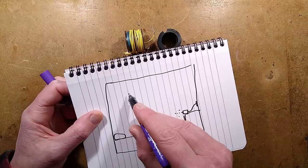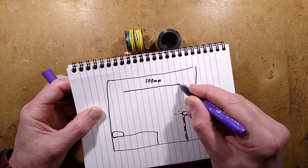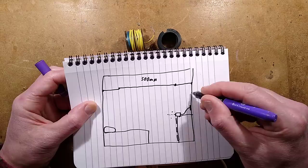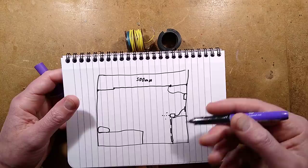The way this does it is different. The Ryazan unit has a thin 0.016 millimeter wire suspended in the air roughly 500 millimeters from the ceiling — that's almost two feet. Tied onto that is a bit of fishing line that goes over to the wall and around a hook, and then another bit of fishing line at the other end. That insulates it because this thing has a very high output impedance. The unit mounts on the wall and has a dangly wire — that yellow wire — that just twists onto the main wire. They say don't let that wire go near stuff because it's got the charge in it and it's going to deplete the effect.